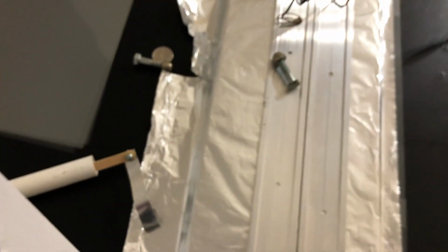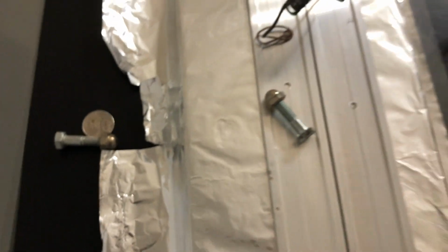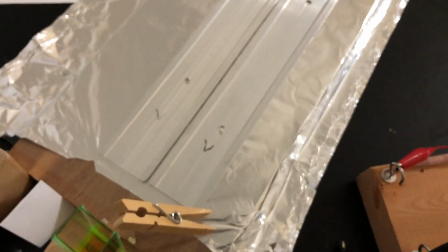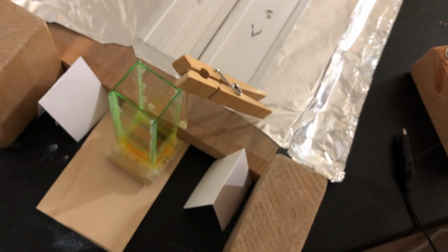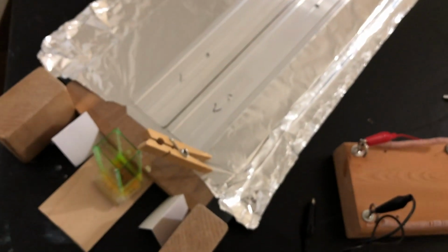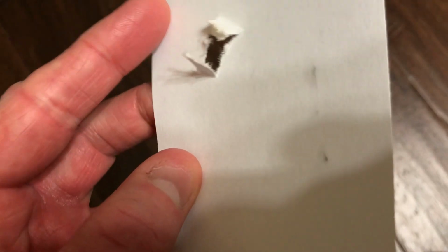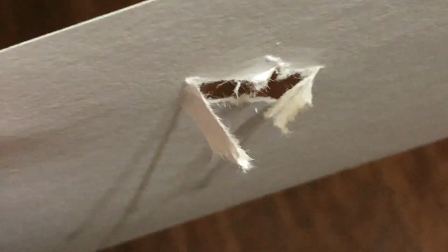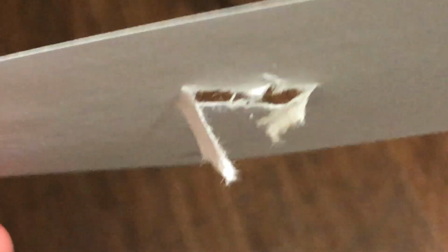But so be it. You see that it actually works, and this is proof of principle that you can build a laser from almost nothing, with no special gases, no fancy mirrors, no fancy exotic laser dyes, almost literally made out of nothing. One more comment about this piece of paper. It's actually an index card, and you can see how the spark just knocked a big old hole in it. The spark actually is a small explosion. It heats the air, which expands very quickly, and the force of that explosion is what blows the hole in that paper right there. And there's really no burning that appears to take place at all.